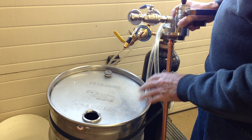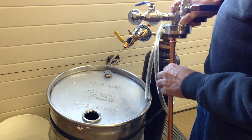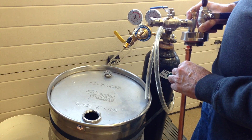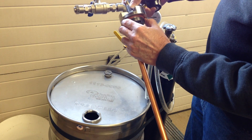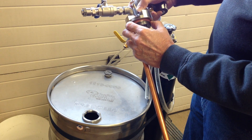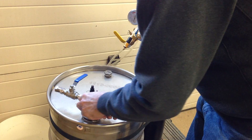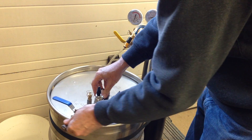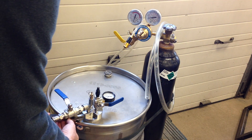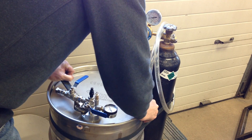This is a 27-gallon drum made of stainless steel, sold by Kaplan Containers in Rochester, New York. These are really handy for hauling race gas around — chemicals, food products — it's fine for food products because it's all laser welded. These stainless steel bungs also have irradiated polyethylene seals, which are recommended for food products or chemicals. I'm going to thread this into the drum — the threads go on real nice — and the drum companies recommend about 40 foot-pounds of torque to get a good seal on the bung. I'll get it nice and tight.